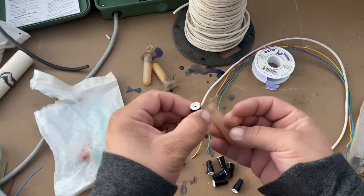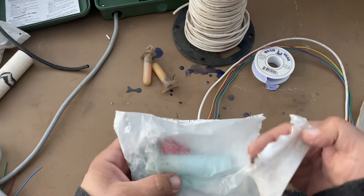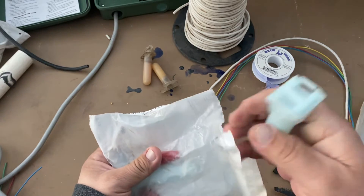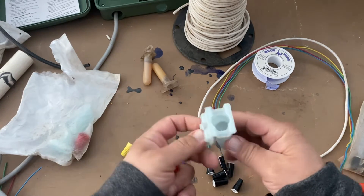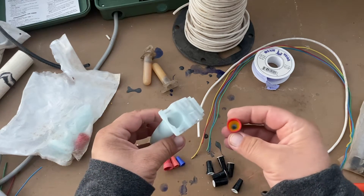There's also a commercial version here. All of these are perfectly acceptable to use on sprinklers, but you need to use a grease-filled version when you're inside a sprinkler box outside, or anywhere it may come in contact with water.